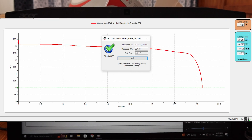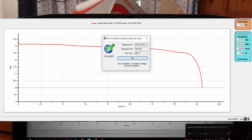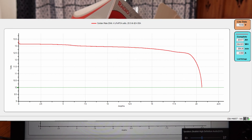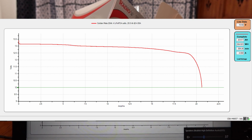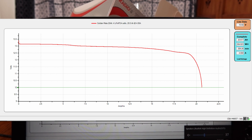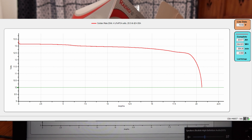The battery is done testing. It reached 20.617 amp hours at five hours, nine minutes, and 17 seconds. It did drop off at about 19 and three quarters — that's where it dipped below 12 volts. But not bad. For a lot of uses that would still be fine; I would use these for amateur radio and I'd still be able to transmit just fine. I'm going to charge it back up now and then run the 12 volt heater on it.